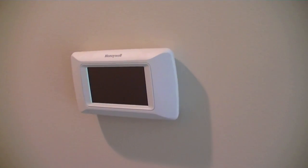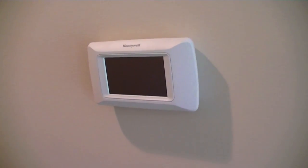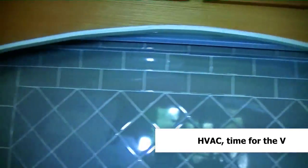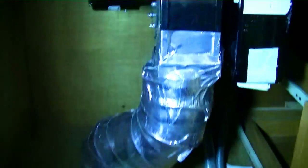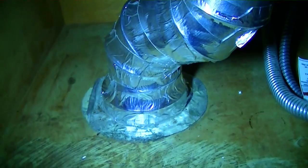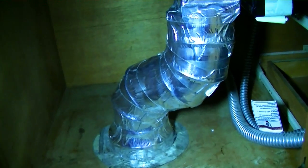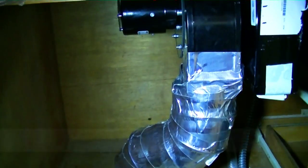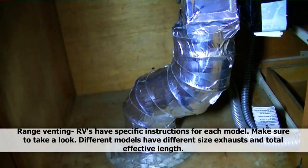I'm doing a little odds and ends today — it's golf tournament day, so I'll be in the house for the most part. What we're looking at now is a little cooktop area in the kitchen, and of course the V in HVAC is venting. So what I did was connect our downdraft range to the 6-inch range vent duct, used a couple 5-inch elbows and a 6-inch end cap, and sort of dovetailed them together and taped it up. I'm going to replace the cap outside — it's an aluminum sidewall.